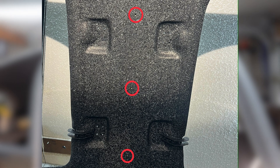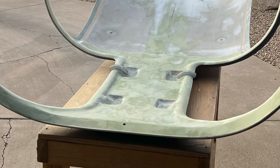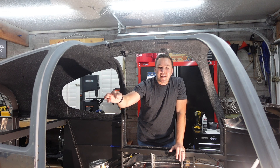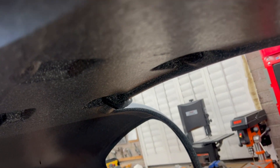The way I did it was I mixed up a structural epoxy — I think it was milled glass fiber — a very, very strong epoxy mix. I made a second one on a test piece and I could not break it off the wood I tried to epoxy it to, so it's very strong. I then used the TotalBoat fairing compound to really smooth and float those anchor points in to where they are now very, very hidden. I'll include a video overlay in the editing process — it looks really, really nice and hides well.